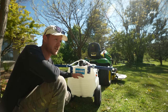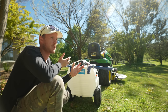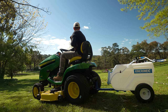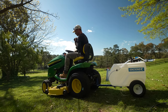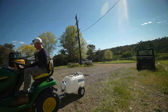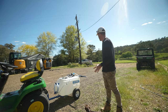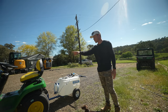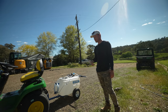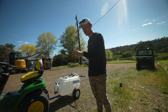So we're going to calibrate it. I put 15 litres in here - that's what I filled it up to. We're going to do 100 square metres, see how much we use, then tip the rest into a jug, measure how much is left, and that's how we're going to calibrate it. Let's measure out 100 square metres on this area just here with some bricks, and we'll set a speed on this mower - the X380 - using cruise control, on low revs, so I know exactly where it's at when I'm spraying.